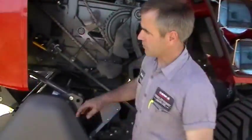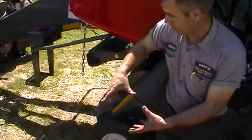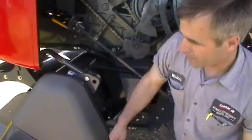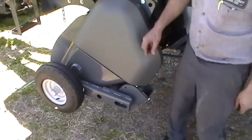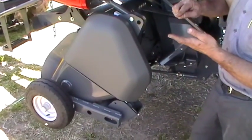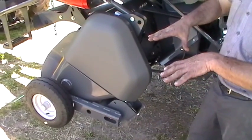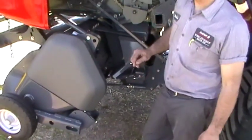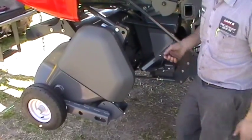On the pickup we have the wind guard, and it's suspended by chains. To get the wind guard down close to the crop, just lengthen the chains. Other adjustments on the pickup are our gauge wheels — we want to adjust them so they're maybe an inch or two below the tines, so that if you hit a high spot in the field it lifts the pickup up over that spot and keeps the tines from getting into the dirt. We normally don't run the pickup on the wheels — we carry the pickup with the baler.